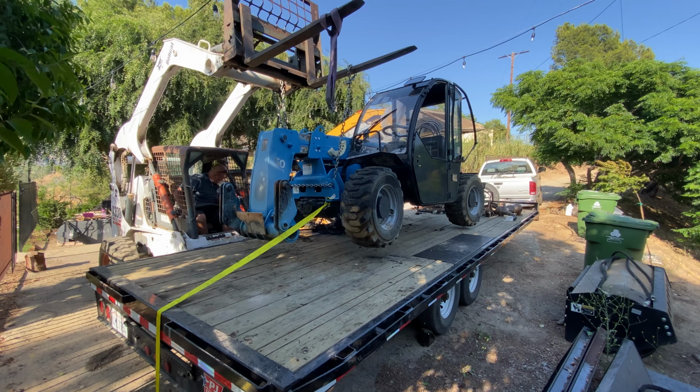Okay, so the first thing I think I'm going to do is clean this area up, use a sander, start at a higher grit, like maybe 120, maybe even more aggressive, and try to get this out and then try to smooth it down, 400, 600, 800. Get it nice and smooth, and then paint it. So, see what we can do. Okay, let's start with 100.